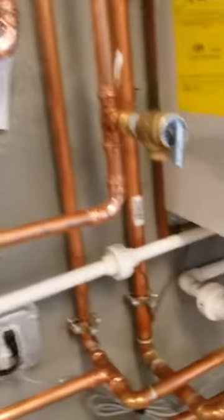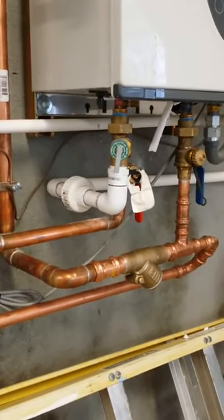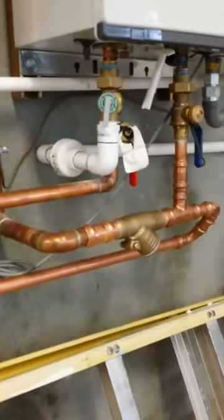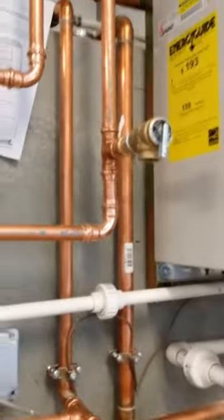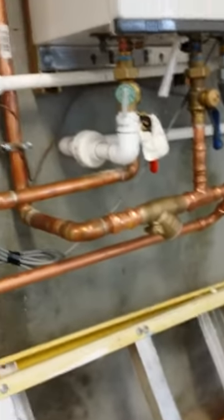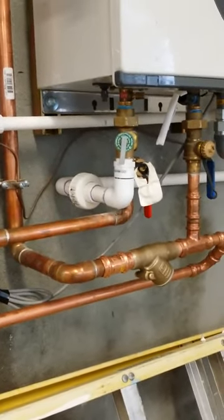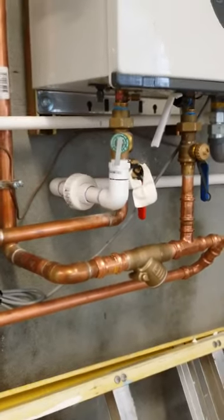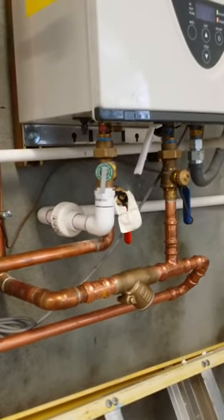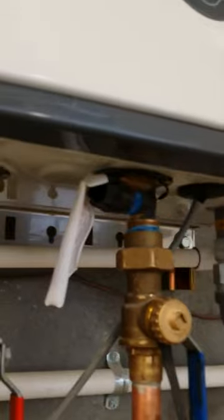One of the biggest things we come across if you're going to do this yourself is you've got to follow your piping. What we got right here is a check valve. What this thing does is as we bring the radiant water back, we're stopping it right there at that check valve, or else the water will flow back — or flow forward in most cases. When you're turning on your faucet to get hot or even cool water, the hot water could get cold and your cold water could get warm or hot sometimes, depending on what the closest faucets up there are going to be.